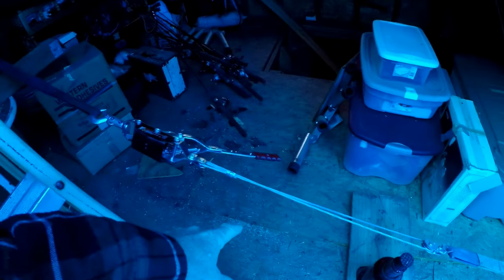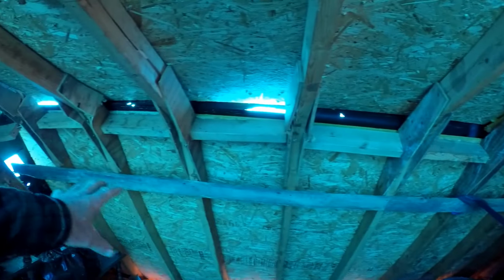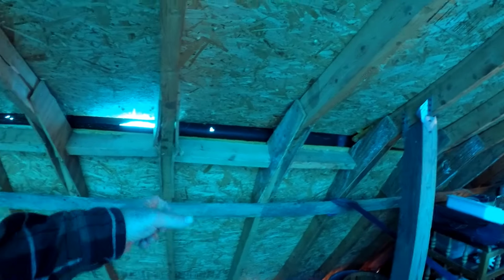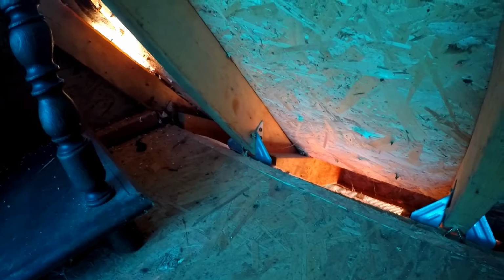It did take a little bit of pressure off of my come along here, so I was able to pull some more, but I am just pulling on a one by here, so I think I'm gonna get a better stiff back on here at some point and then be able to pull on everything. Like I'll get a couple 2x4s or something and lag them in there, then I can pull everything a little better, because those brackets are bent back. They took a shot. This whole thing shifted when it got hit by the tree.